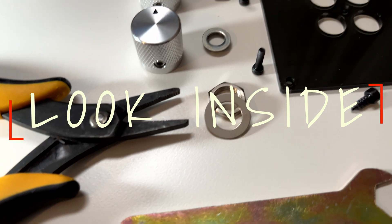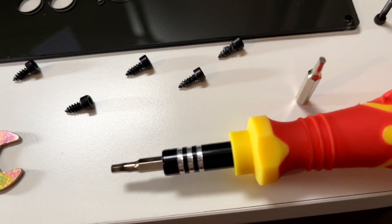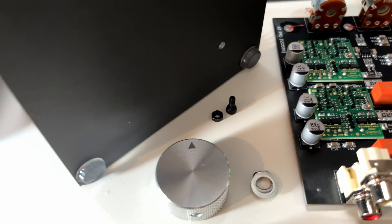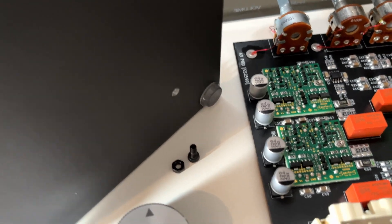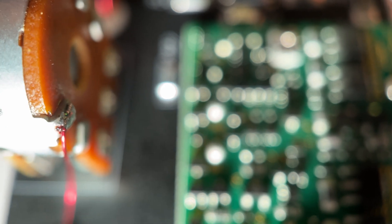When you open this amplifier, you need to be careful not to break the acrylic and not to damage the thin wire that is attached to a screw underneath — at least in the aluminium version. The wooden chassis will not have that, I believe. The concern here is avoiding electrical discharges through the potentiometers, because the chassis also conducts charge.